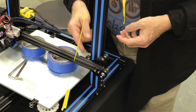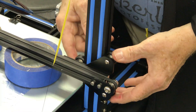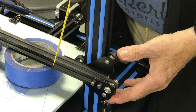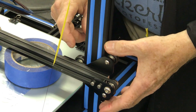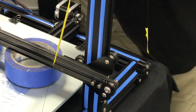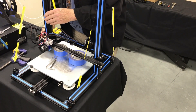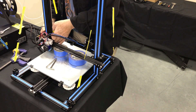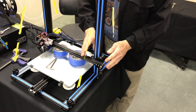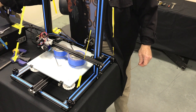We want to take note of which wheels are loose. Both the inside wheel and both outer wheels are loose on here — that's really no excuse for that, that's total bad news. The inner wheel has the eccentric adjustment on it, so if I turn this nut it'll bring these two wheels closer. However, these beams are going to have a hard time collapsing in. Looking at this side, the wheels are adjusted about right — the top one's a little loose, the inside one is a little tight. We're going to concentrate on getting this wobble out of here right now.